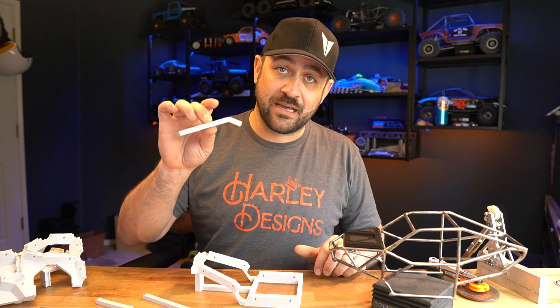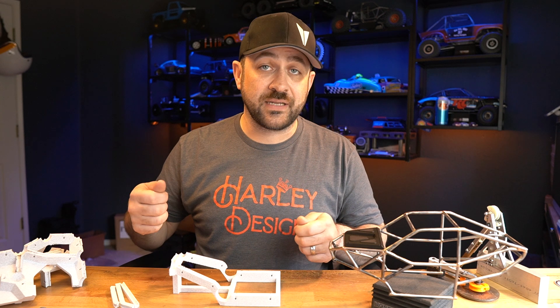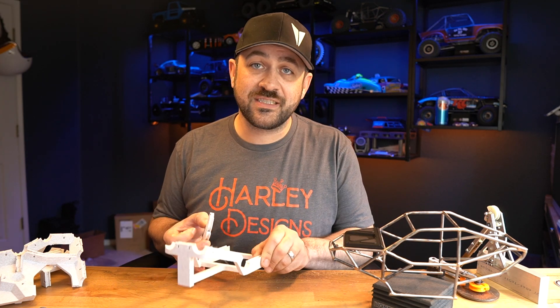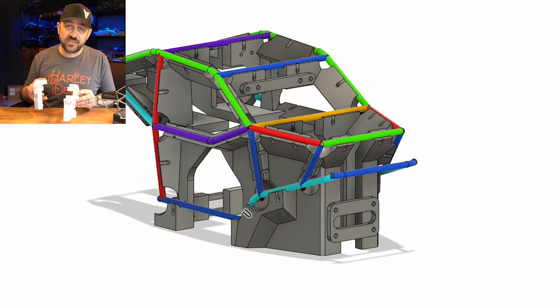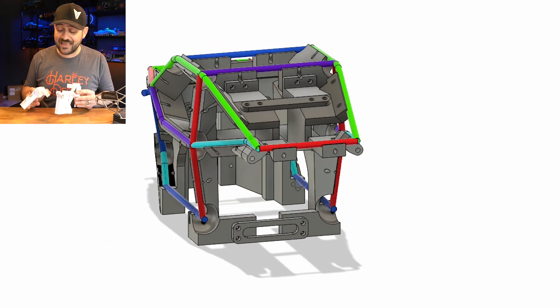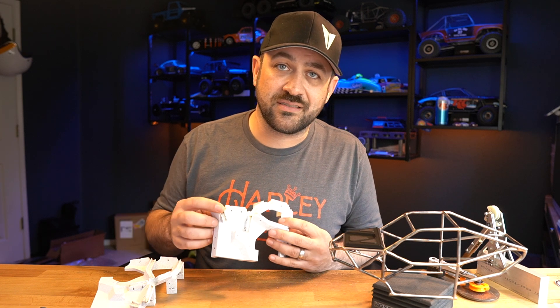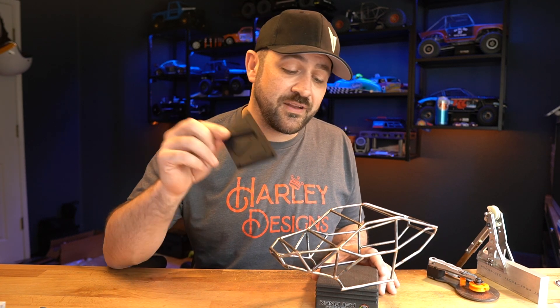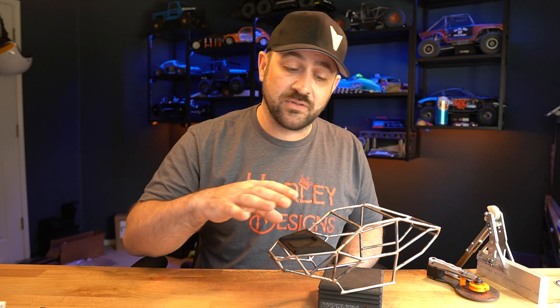Every tube in this chassis has a template, so you'll know exactly how long to cut every single tube. You'll put all your tubes in the jig — there are holes all over for zip ties so you can zip tie everything down, which also helps pull things into place if you're a little off. Once you finish the first stage, you move to the next — in this case the center section. These are all done in multiple pieces so you can get your tubing in place, finish the entire stage, then deconstruct and pull it out of the chassis from the inside. As part of the package you'll also get files for things like the hood, the interior configuration, the skid plate design, and the shift servo mounts.